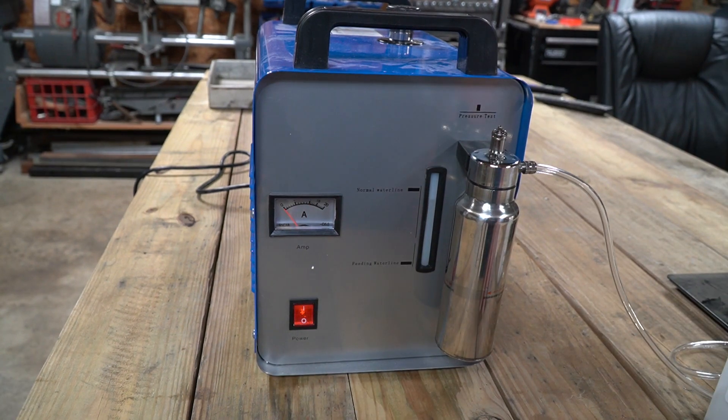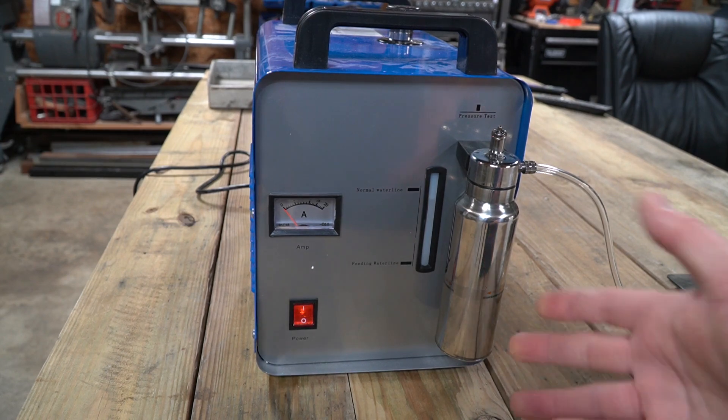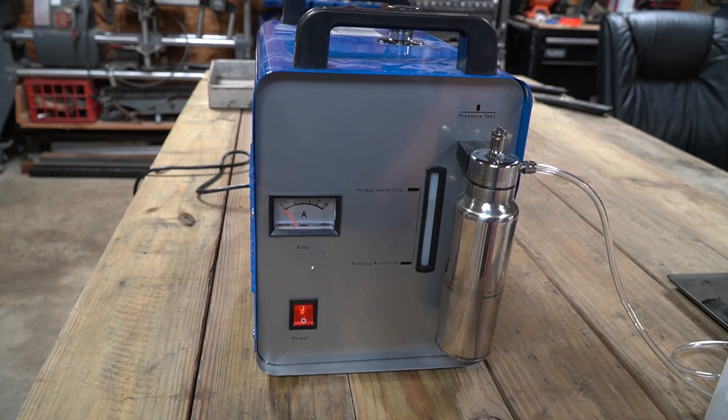It's been about five minutes and it just shut off. I went back to the manual and the working PSI is just above 20 — at 20 PSI it should shut off, and it did. We are ready to fire up a flame and see how well this thing works.